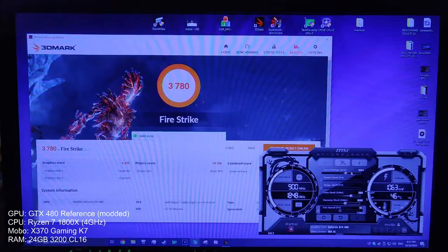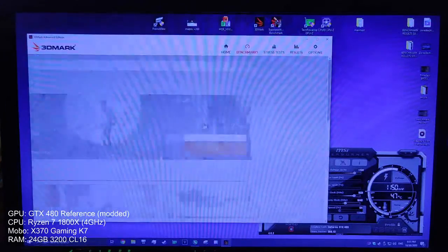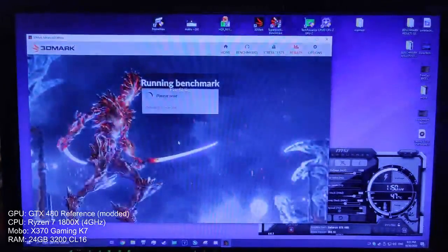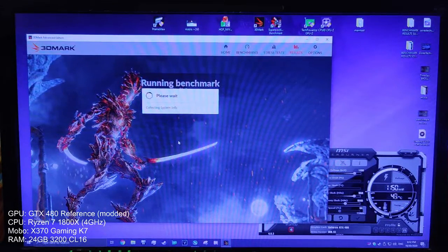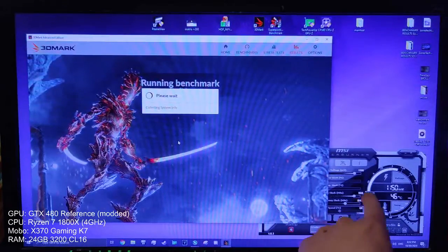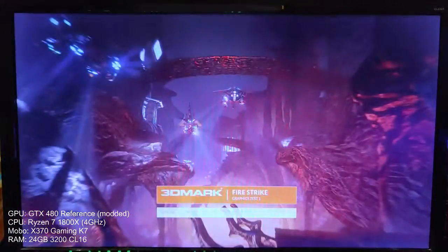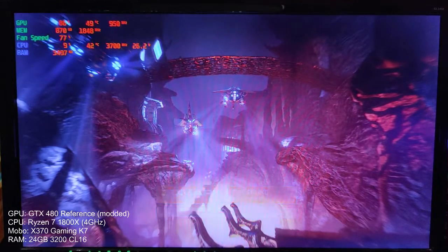Yeah, but 950 is not gonna pass. The question is, if I now take it to 115, is it gonna run 950? Dude, if this thing is running 1 gigahertz at 1.2 volts, then I'm gonna be really happy, but I don't really feel like it will. Let's just test it. We just went about 100 millivolts higher, and we're just giving it 50 more megahertz. At some point, it just gets exponential. You need exponentially more voltage than clock for clock. So I don't know where that starts, where you just need way more voltage for a couple megahertz.